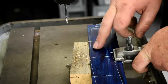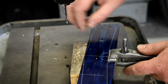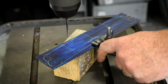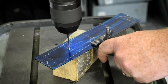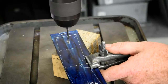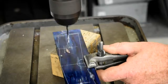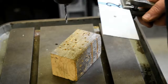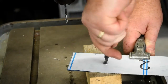We're going to drill Part 2 — two holes to drill in this, so it's only going to take a second to drill them. Then get a big drill bit and just clean up the backs of the holes, how the burr forms.